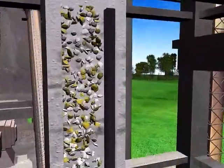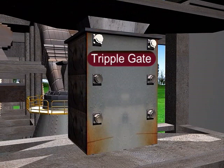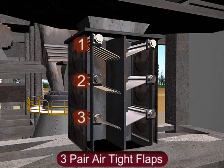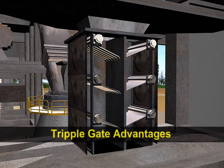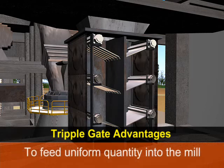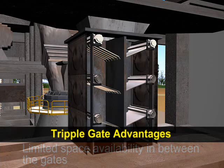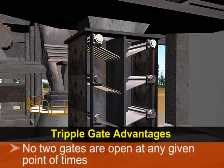The limestone mixture goes to the main triple gate through the feeding belt. The triple gate is one of the elementary processes facilitating entry of raw material in three stages due to its three pairs of airtight flaps. Its advantages are to stop false air entry into the mill and to feed a uniform quantity into the mill due to its intermittent opening and closing flaps.